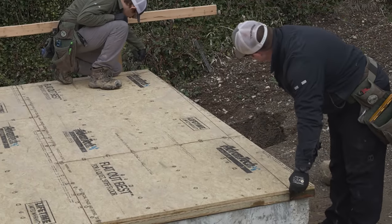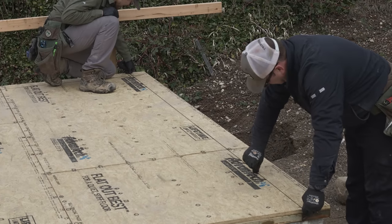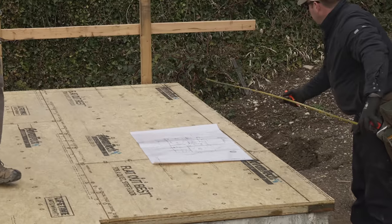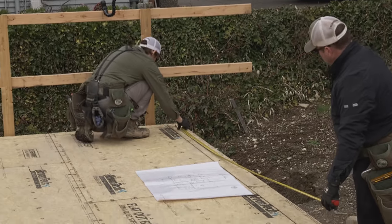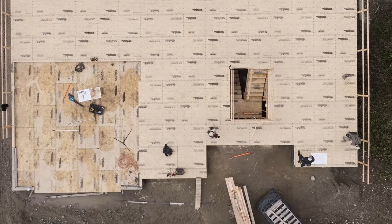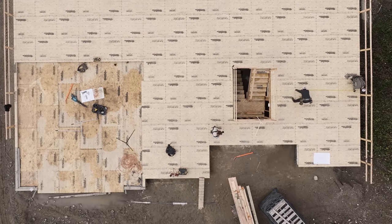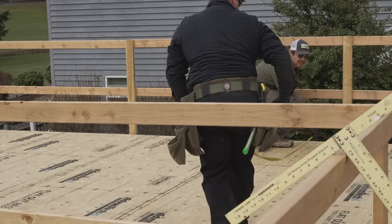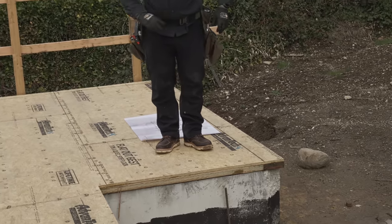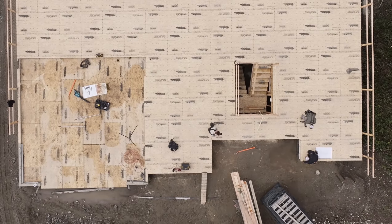I mean, and we're over the circle, the one closer to you. Yeah, sorry. Because I cheated that one just a little. So can you hold me here? Just hold me to the black line. And yep, I'm just gonna match this. So I'm 127.6. Then we'll go back to the tamper. And we'll do the same thing. 127 3/8. And I believe that wall is 2x6 to 2x4, right? So we'll snap this guy through and then 3.5 it. All the way back. Yeah.